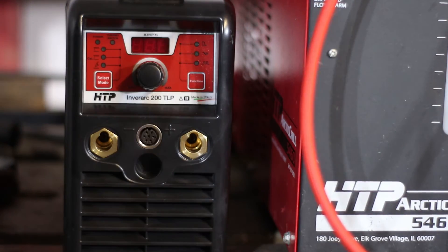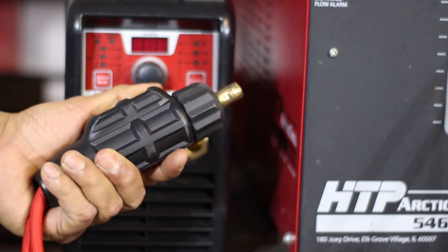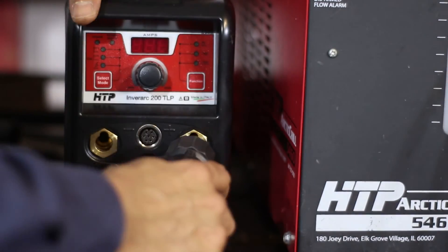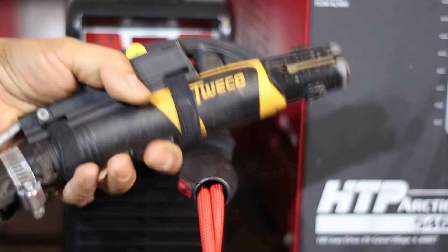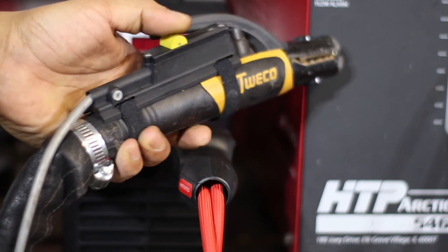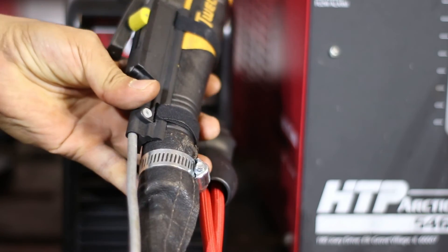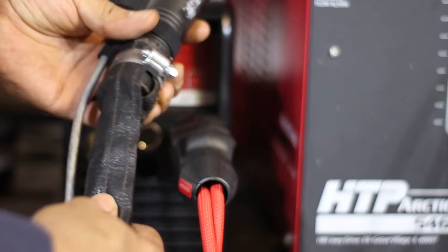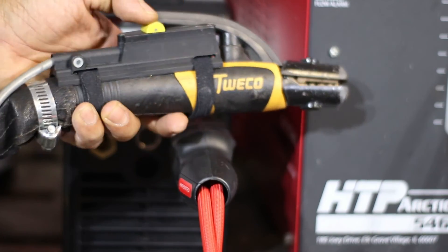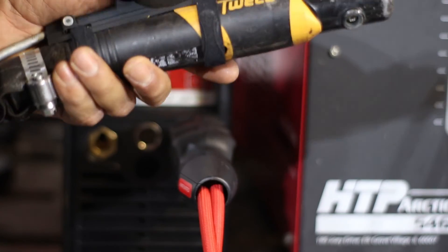Stay tuned for my next video because I'm going to be using this for stick welding. This is a water-cooled DINSE connector, hooked up to the cooler. What I have here is one of a kind — this is a standard electrode holder that I converted to a water-cooled stinger. I'm using CK Worldwide: a 50-foot TIG torch cable for the power cable and for the water return. I even put its own slider on there. I'm using 50-foot lines and it's nice and light — I just wanted to try it out to see if it would work and keep the weight ultra light.